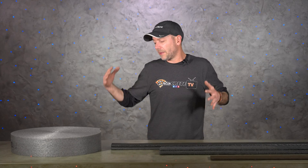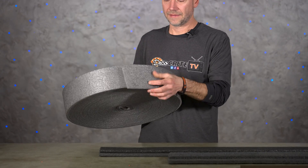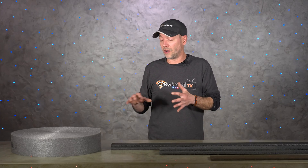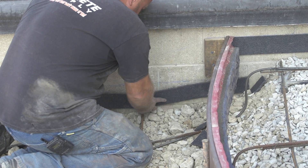It's still kind of serving the purpose but you never want a gap in that concrete. Next up is foam expansion, which can come in a couple different varieties. The most common is rolled foam — we used to use a ton of this stuff and it's a great option. It's really easy to store and haul to jobs, just in nice rolls. Most expansion comes in five-foot, sometimes even ten-foot sections, so that's a big advantage. It's also really easy to cut — you can just rip it with your hands. What I like best about rolled foam expansion is how flexible it is; it won't break, and if you're pouring up against split face block or a retaining wall it does a really good job of contouring along that wall.